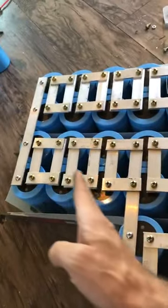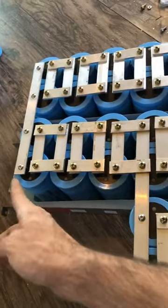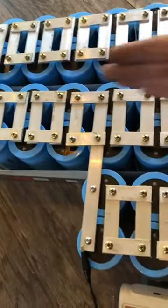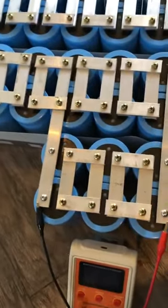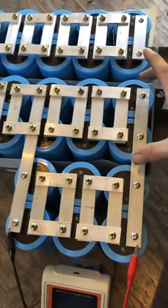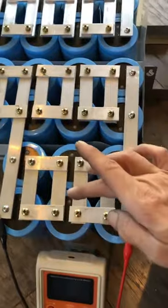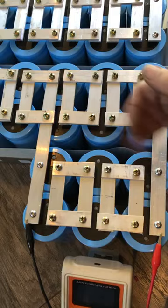So this part is the step-down transformer, and it would be wherever we decided we wanted our tap point. We would just increase these capacitors up — if we wanted half the voltage out of it, then we would fill this right up to here and then we would have half. But this capacitor is actually this group of three capacitors here — three pairs — that is part of this capacitor and part of this capacitor. So it's actually really cool.